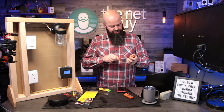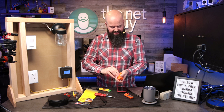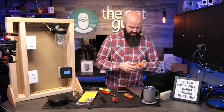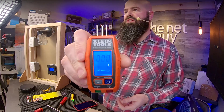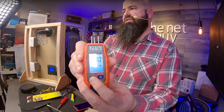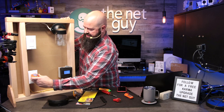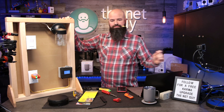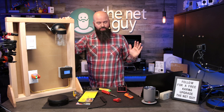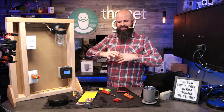If you have these two tools in your electrical bag, you can do absolutely so much with them. This second tool's main purpose is to check regular US wall plugs. When you plug it in, the lights on the end will tell you if it's wired properly or not. I'll turn it on — it does a quick light test — and then you can hit the button to test the GFI. It's saying 'open hot' right now. When I plug it into my test outlet, you can see it goes green right away, meaning I've wired this outlet correctly.